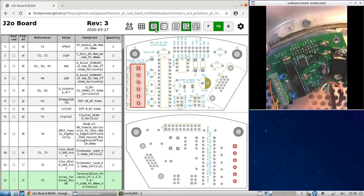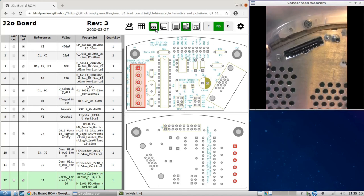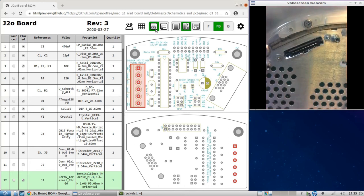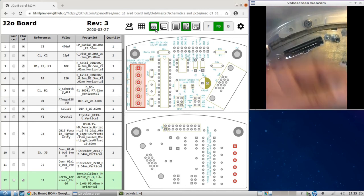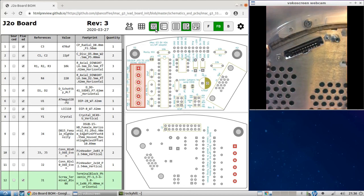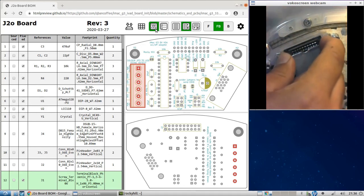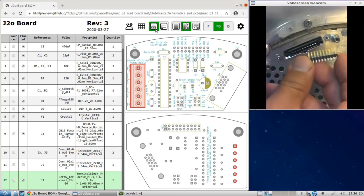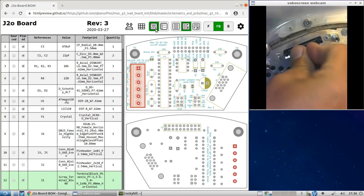All right. Okay. So now here is the J20 connector. And eventually, the board that we built earlier will go there. Now, the reason I left this header for last is because had I soldered it in here first, I might have gotten this orientation just a little off, making it difficult to install. And although this connector does wiggle a little bit, it isn't great. So what I like to do is take this header and actually plug it in first.